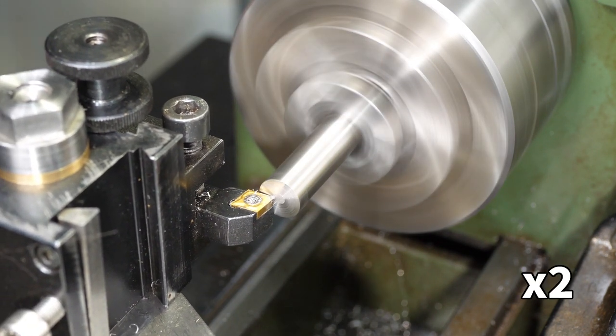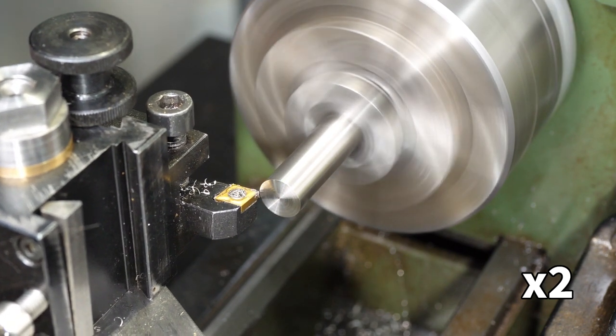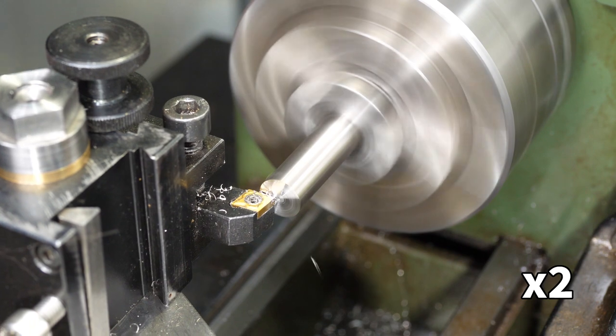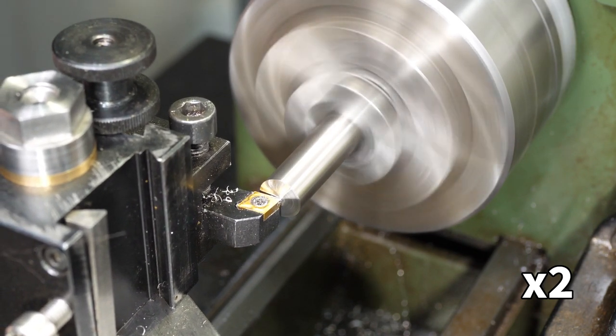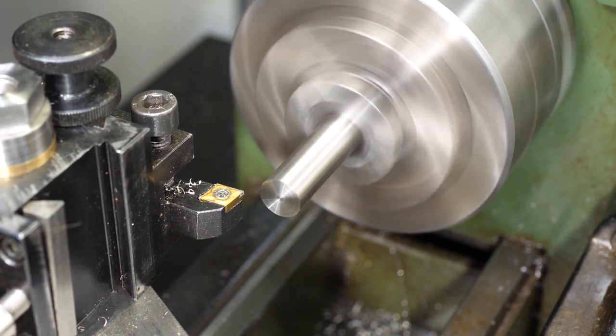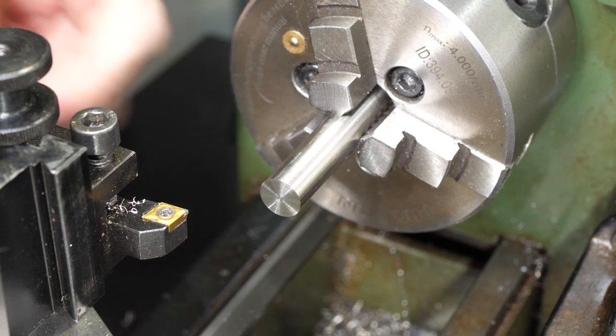I started out with this piece of 316 marine stainless I had left over from another project. At this point I had no real plan and hadn't even decided what length to work with, so I fed the whole piece of stock through the spindle bore. 316 isn't well suited to machining. It work hardens very easily, but fortunately it burnishes to a lovely finish with insert tooling.